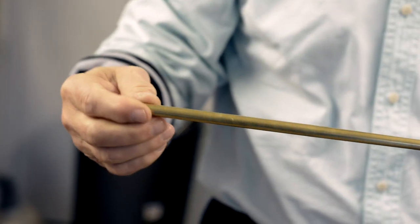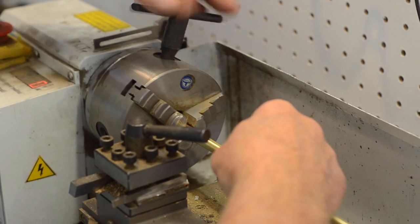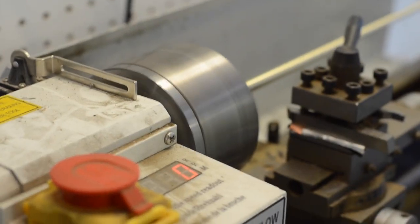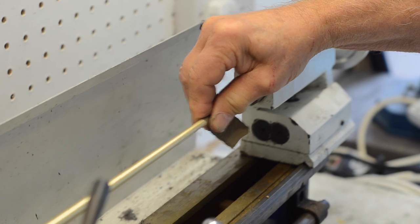My method is entirely different. I use drawn brass tubing without a seam and I work on the drawn brass tubing to make it into a conical shaped tube. The drawn brass is processed into a conical shape by reducing the small end down and keeping the wide end open. In the process, the walls of the crook at the small end are thicker, while the other end is thinner. That method is cheaper to produce, easier to produce, more reliable and stronger.